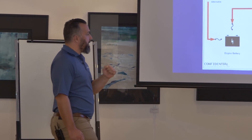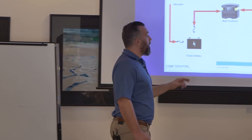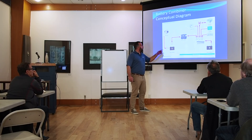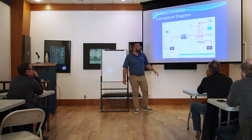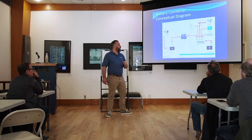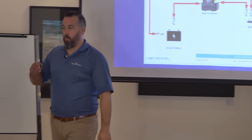Here you see an unswitched distribution. Because we like modular and doing things right, we put an unswitched distribution right here. You've got a fuel cell going in there, maybe an inverter charger, a solar controller, or even a DC generator. How are those devices going to share charge with your house battery, or an alternator going to your engine battery sharing the charge with either side? Some battery chargers have multiple outputs, but newer inverter chargers just have one output. Whatever's connected to the battery is what it's going to charge. A battery combiner does that sharing for you.